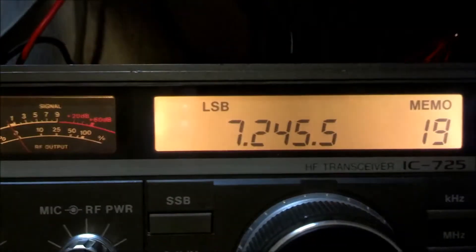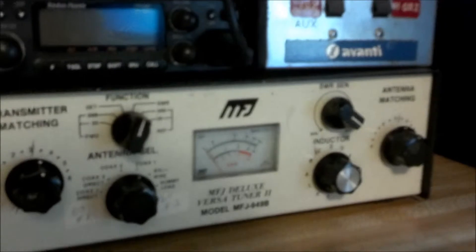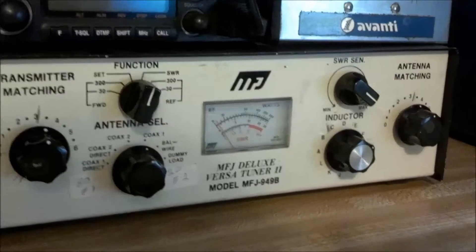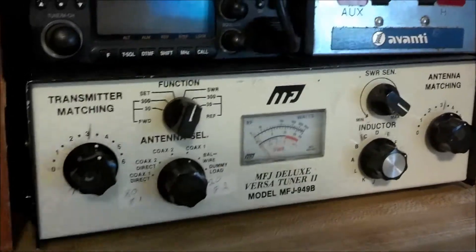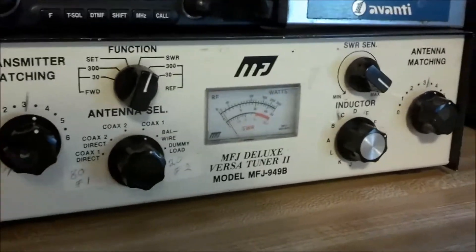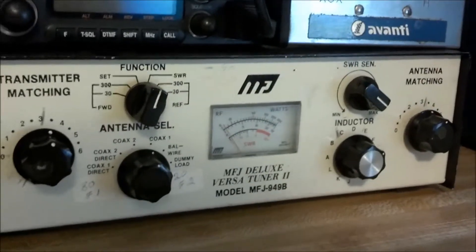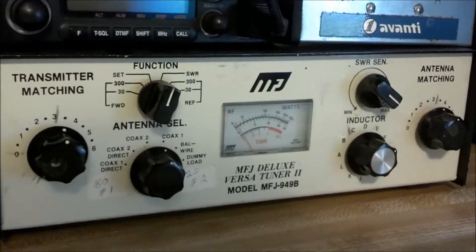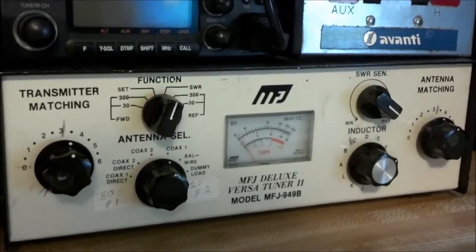Watch the lights on the radio dim - there you go. Sometimes you have to turn the power down real low to get it fine tuned in, then turn the power up slowly to make sure it's zeroed in. I enjoy doing it this way. Maybe I'll get tired of it and get an automatic tuner, but I like doing it this way. This antenna tuner only cost me $30 and does just fine. I made about 30 or 35 contacts in 21 or 22 states for the Field Day competition, so I was happy with that.